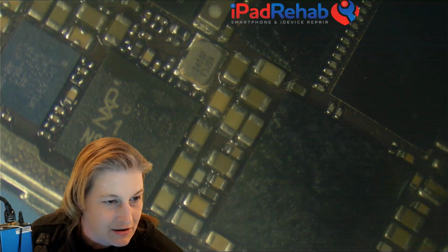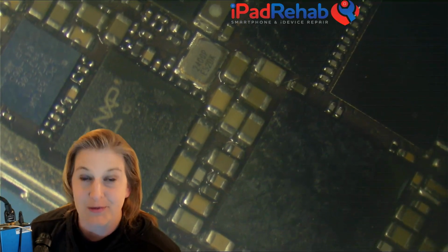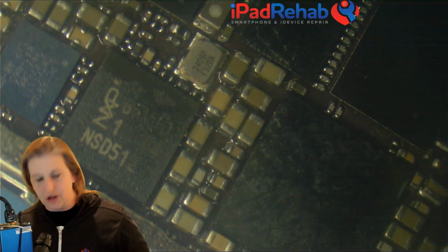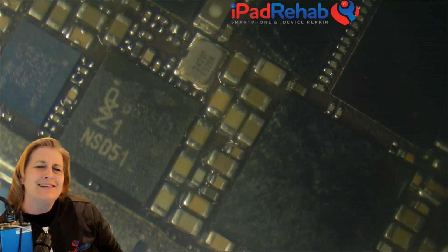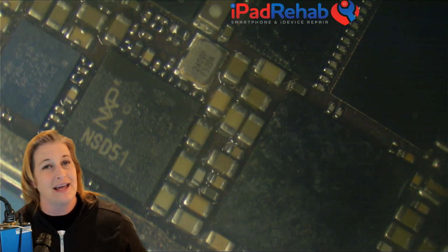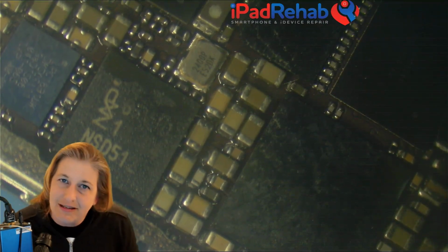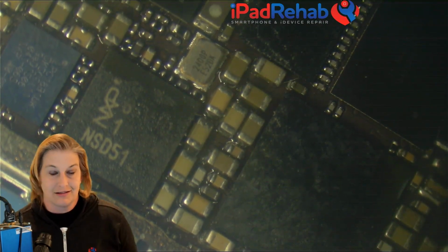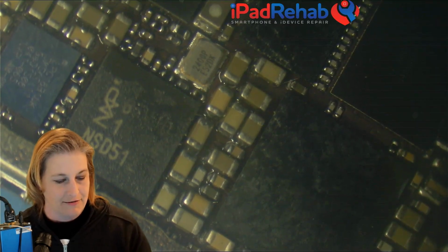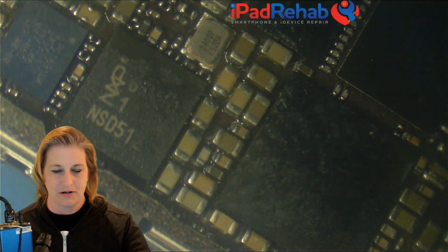That then goes to PMU. Jonathan, remember what we talked about. You gotta look it up on the schematic. You gotta know your line. It's your baby. You gotta know everything there is to know about it. This is PP-LCM boost line. So go on a hunt. Go grab that 6+ schematic and you figure out, does this line go to the PMU? Figure it out. Maybe it does. Maybe it doesn't. But it's definitely important to know.